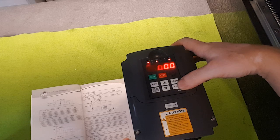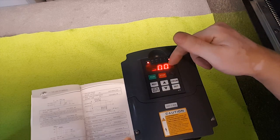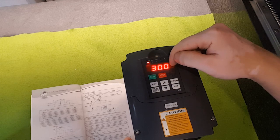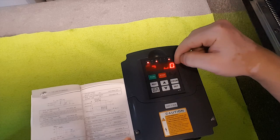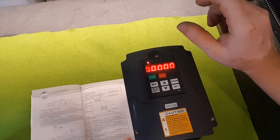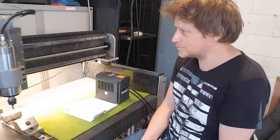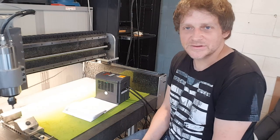Program 144 is rated motor revolution, which is a bit strange because it's rated at 50 Hz. So if your spindle is 24,000 RPM at 400 Hz, at 50 Hz it will be running at 3,000 RPM. Set this to 3,000. At 50 Hz your spindle spins 3,000 RPM, and at 400 Hz — when you set the max — it runs at 24,000 RPM. With that set, your spindle should be operational and quite safe.